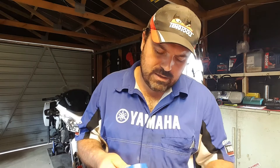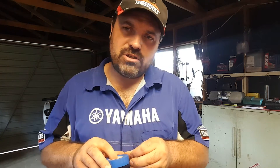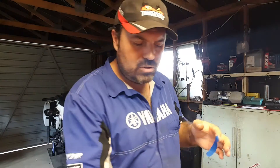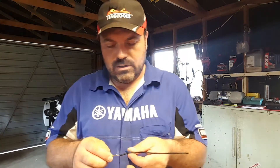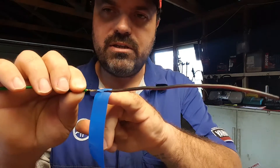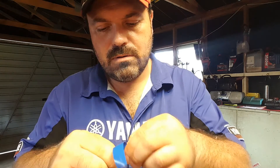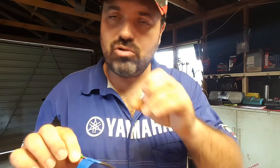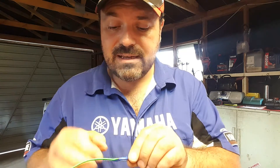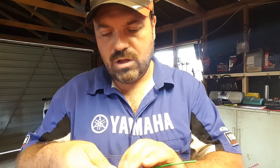Fitting insulation tape onto the wire — you want it to look nice and neat and tidy, and it's actually quite difficult to do. The first rule of thumb is to make sure you've got clean hands, and just take off a small amount — don't try to wrap the reel round and round the wire. Grab the wire and put the tape on about two thirds over the insulation at about a 30 degree angle if you can, then just run it down the wire so you end up with about double thickness. Try to touch the adhesive side as little as possible.